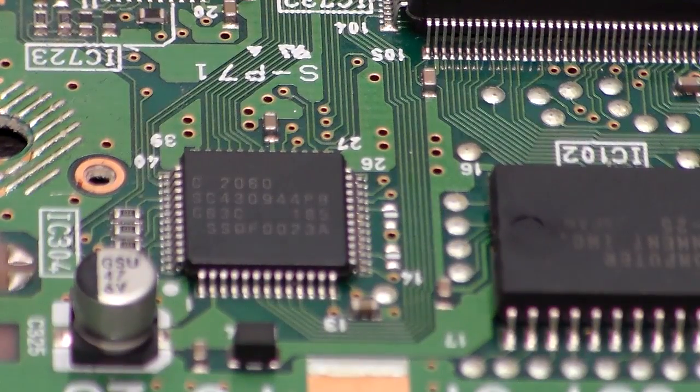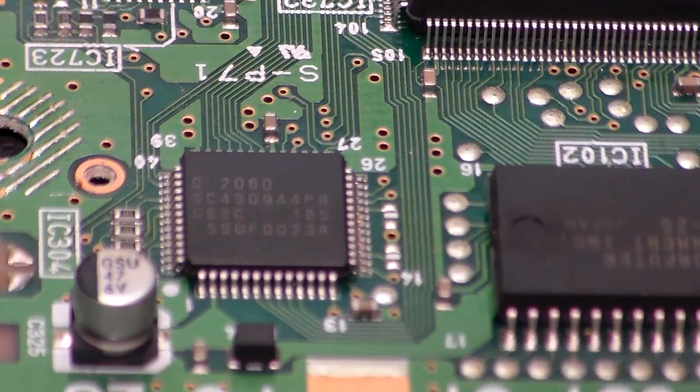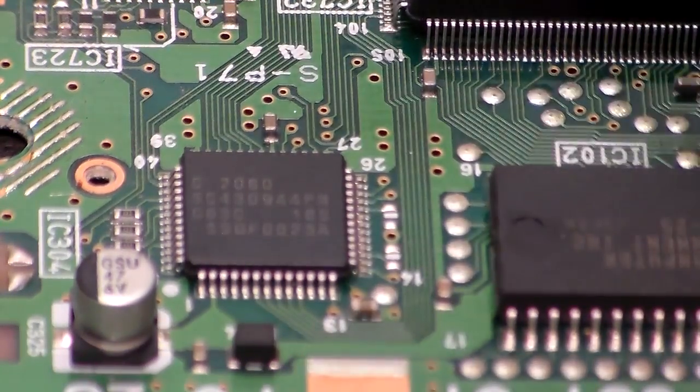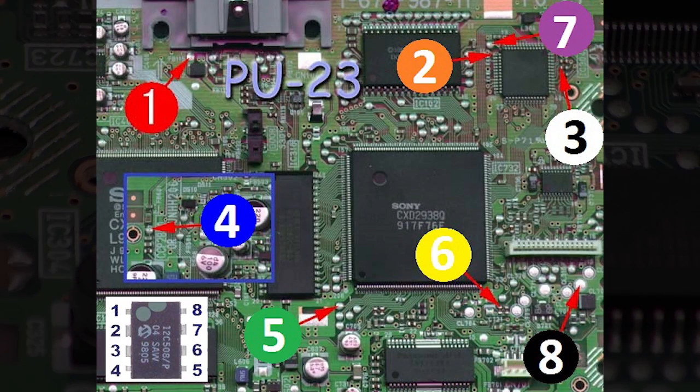What we're going to focus on is a specific area on the motherboard — it's usually a chip that looks like this. When installing a mod chip in a PS1 you're looking for a chip that looks like this; if you look at the installation diagrams in the link in the description, you won't have to worry about finding it because it's in the picture. The guide I'm going to use gives you some easy solder points. I recommend going with this guide for beginners — it gives a few solder points that are pretty large and easy to solder to. However, I'm going to make a couple of variations.